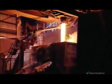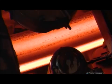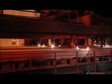The alloy then runs down a ceramic tube that shields it from exposure to oxygen, which would ruin the metal. From there, the molten metal flows into molds which extrude it into continuous rectangular blocks called blooms. Acetylene torches cut each bloom into three and a half meter lengths.